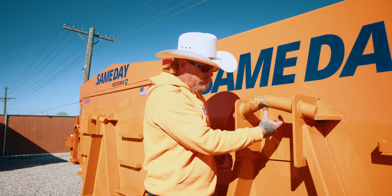So this is how I was taught. You can see how that bar is sitting right on top of your thumb on your hook. Once you jib back and start raising the can up, you just feather it back just a little bit so that hook sits back down into that saddle. These concrete cans can weigh five to seven tons sometimes and it can be really violent if you just start raising the can — it'll rock your truck pretty good.